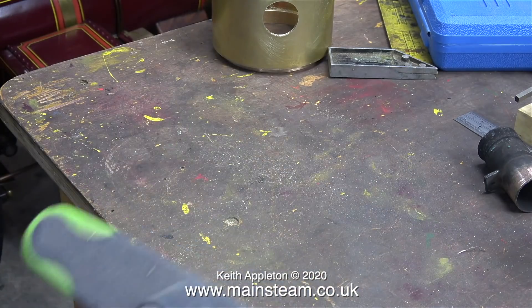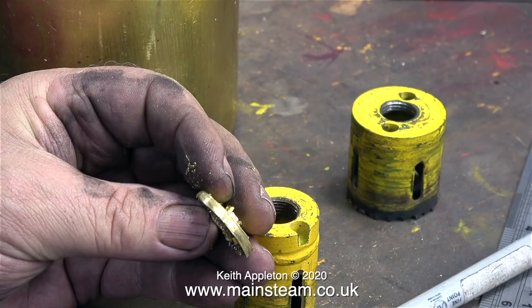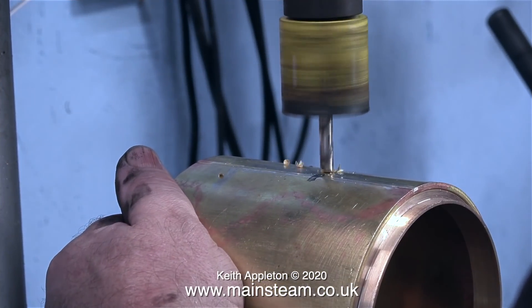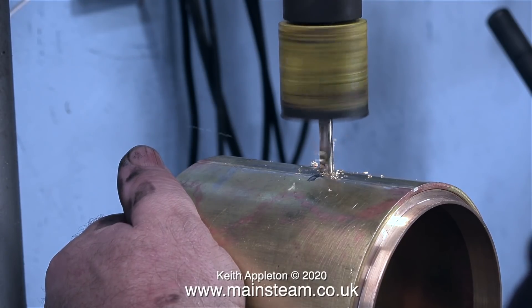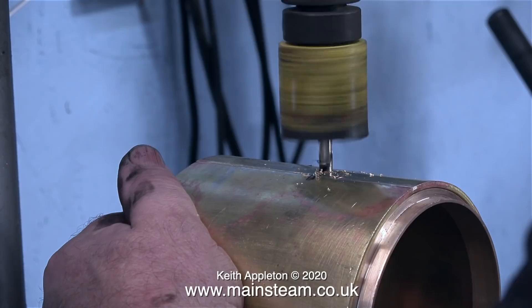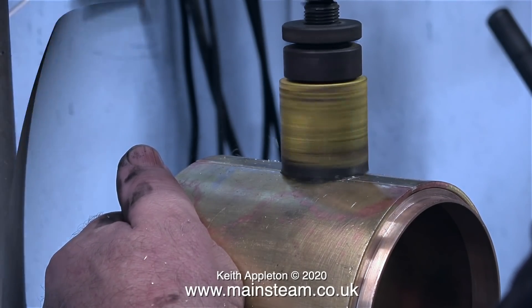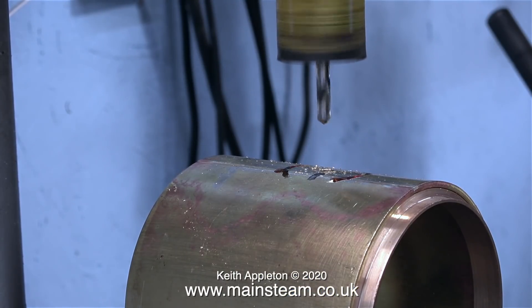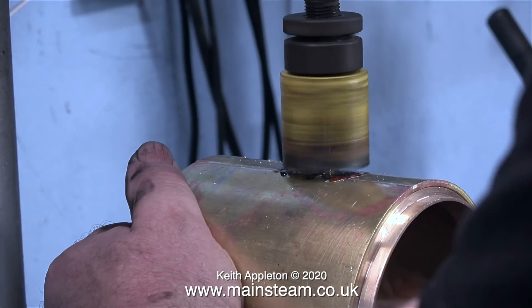Time now for a quick bench clean using a broom. Here's a piece of brass that I removed from the cutter. Now it's time to cut the hole underneath the smoke box, which needs to be a bit bigger. The way I normally do it is to drill one large hole underneath the smoke box, and when everything's fitted together I make a special plate which fits around the blast pipe and the steam inlet pipe, and with the help of a suitable sealant makes this area of the smoke box airtight.